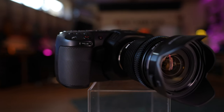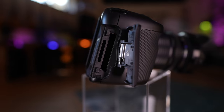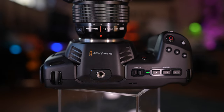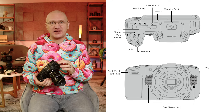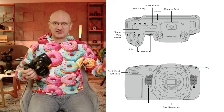This is a camera for someone to put a rig around. So you would have a focus wheel, that's why we have the gears here, where you do the focus manually as a cinematographer. This is a cinematographer camera. You would have an HDMI out in HD only. Yes, the HDMI out does not carry 4K. This is a big issue for me, which is why I first sent it back, because without 4K HDMI out, I couldn't incorporate it into my 4K Blackmagic switching rig.